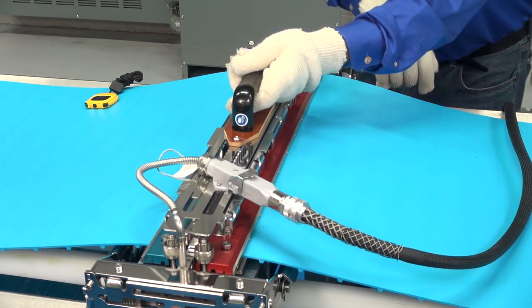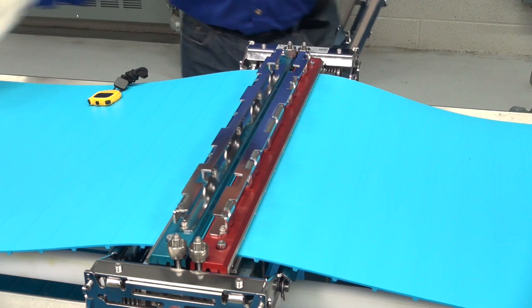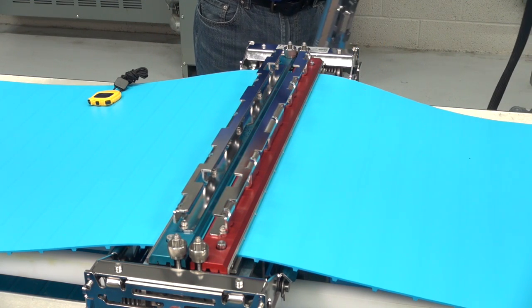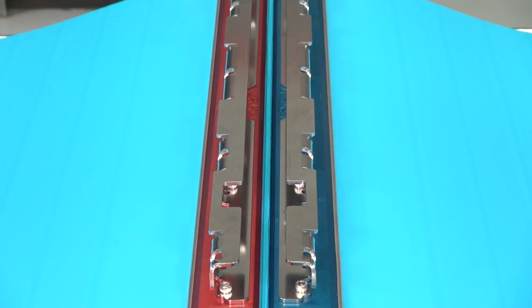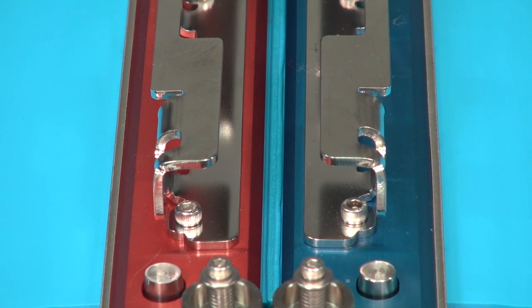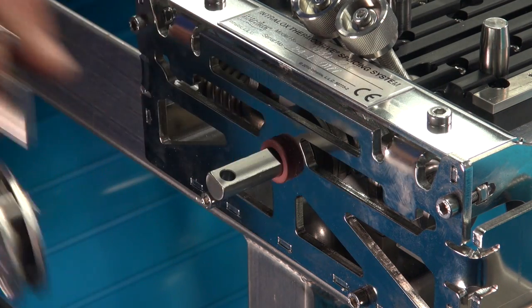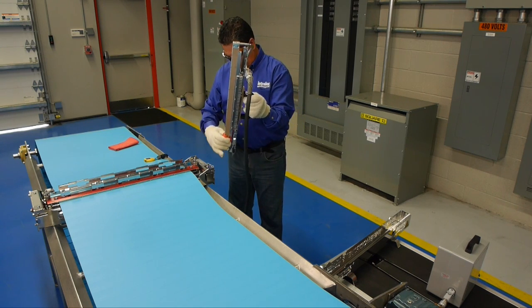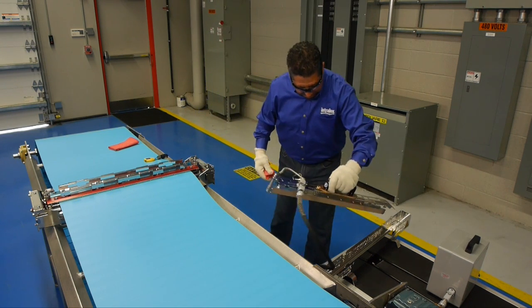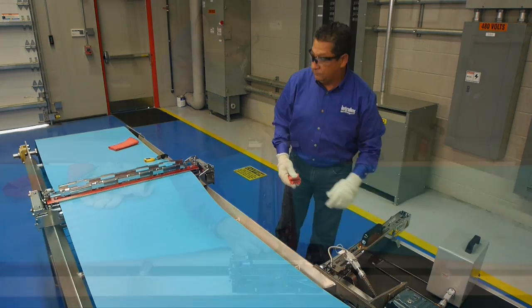When the melt time has elapsed, open the groove decks and remove the heat wand. While still holding the wand, turn the crank handle to gently close the groove decks within five seconds — you'll hear that click again. Closing the groove decks quickly, but without force, brings the two heated belt ends together and is essential to forming a good splice. Remove the clamping fixture handle. Let the unit stay in the closed position and cool down for two minutes. In the meantime, wipe off the heat wand again and place it in the stand.